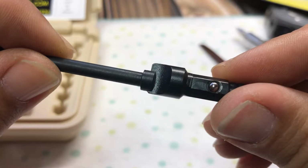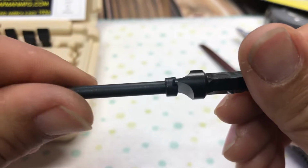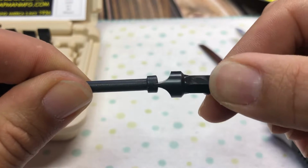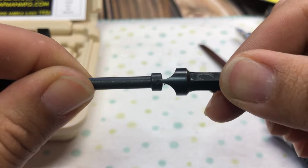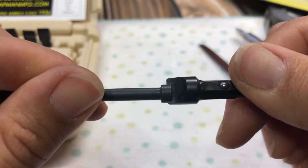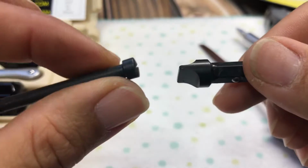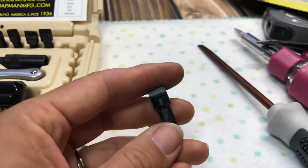This is a great fit. It's a little bit too large, but if you have the space, then that's actually fine. But that is what you want. And then when I turn this, there is absolutely no play at all. So this is an absolute perfect fit, which means that when I use this, I will have the very least possible chance of it stripping this screw and the most amount of direct force applying directly onto this to loosen this up. Okay, so that is the ultimate goal.